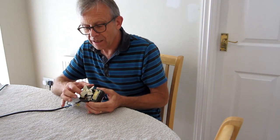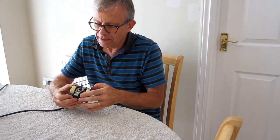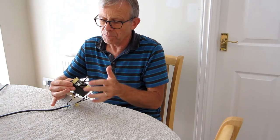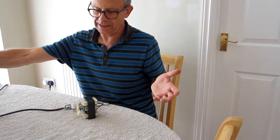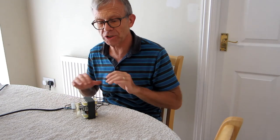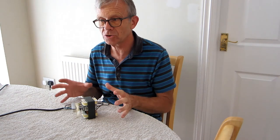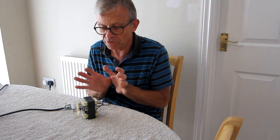Here I am at the end of the project. I've got my coils nicely insulated, all varnished up, everything reassembled nicely, the pole pieces all staked back in — the motor's in one piece and it still runs perfectly. No noises, it's turning in the correct direction, everything's great — it's ready to go back into place and run just as it did before it melted down. Just before I finish, a quick caution: never ever attempt a project like this if you're not 100% trained in working with mains electricity. Mains electricity is very dangerous — you should never attempt anything unless you understand the requirements for insulation and safety, not just while working on it but when the project is finished.